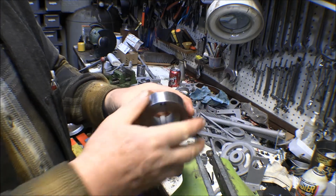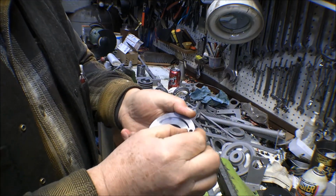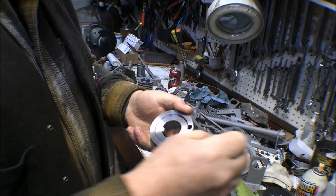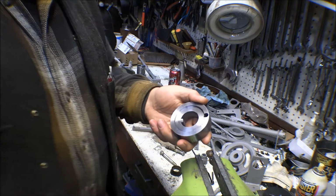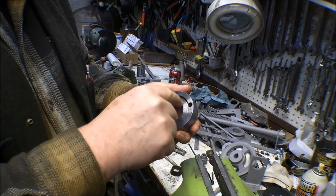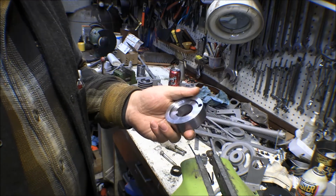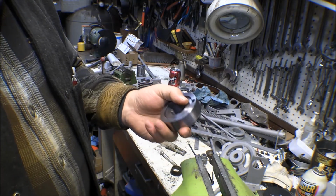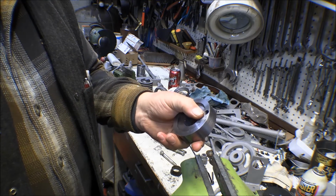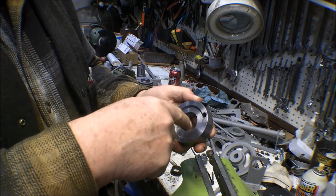We got this block here. This is the bushing that goes behind the blade. So I made up this drill bushing guide and put in there to center the pilot drill on that hole, and drilled that hole out with, I think it was a number 21 drill bit, 19 or 21. Drilled all the way through it, and it went pretty good till it got out on this end where that weld was, and that weld was pretty hard, but we punched through it. And then once I got that hole piloted out, I took a 19/64 drill bit and drilled down through there and drilled the rest of that shaft out of there, but it just left a little rim around there.